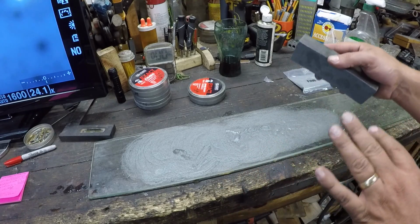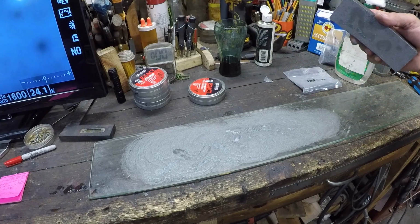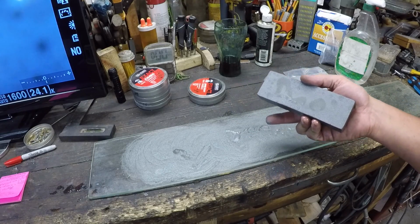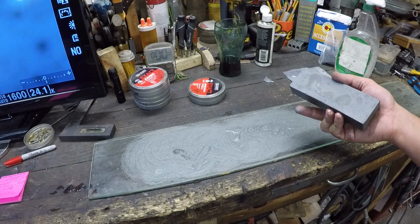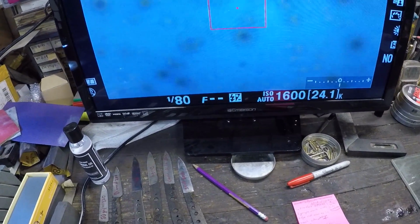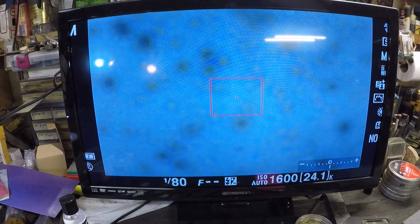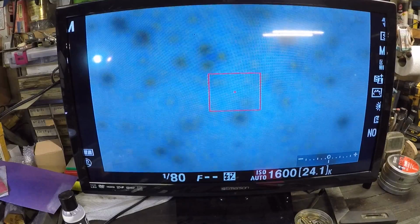So any low dips in your sewer line, where the water goes down, this grit is going to fall out of it and settle in those dips. It might take 10 or 20 years, but it's not a good thing for your sewer system. So rinse this off into the garbage can, get the majority of it off in the garbage can, and then rinse the last little bit of it off in the sink.